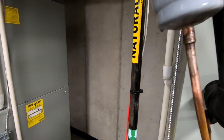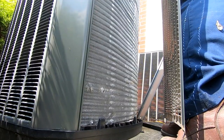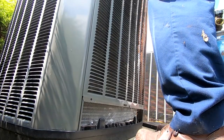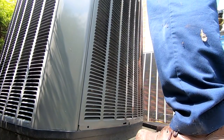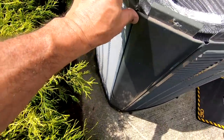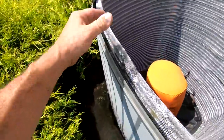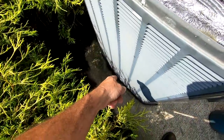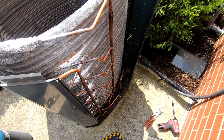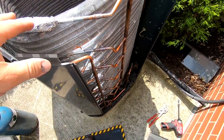No leaks. Good deal. Time to evacuate. Quite the interesting contraption they've got there. It looks like these outside pieces lock at the bottom first, bring them forward after you lock them in. Then the tops just kind of slide down and there's a little channel at the bottom they've got to set in. This is the first coil on one of these I've replaced, so not very hard at all — actually kind of easier than most of them I've ever done, almost like they knew it was going to go bad.